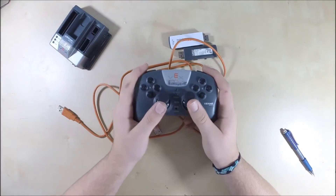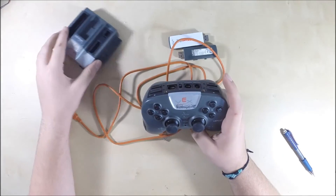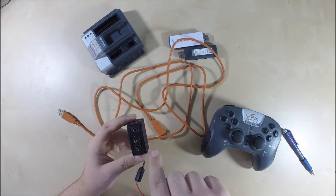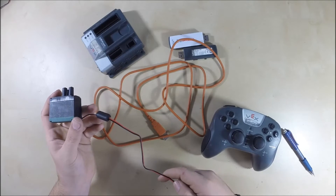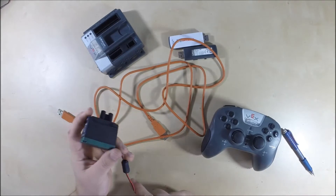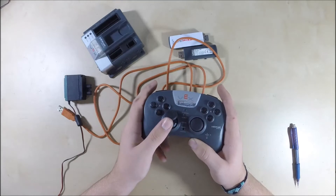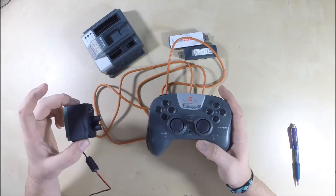Then we have your joystick. Your joystick has eight channels, and that's how it addresses the motors. The motors can spin either left or right — clockwise or counterclockwise — which is either negative 127 or positive 127. That's what we'll be taking care of in the programming. If you want to turn the motor forward, you'll want that to control forward, and then that'll be backwards — two different directions on the motor.